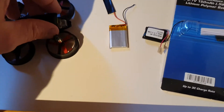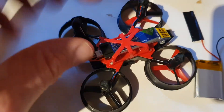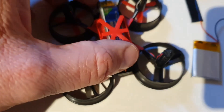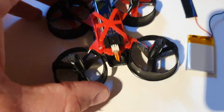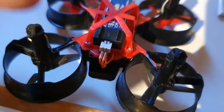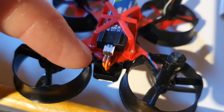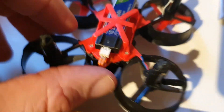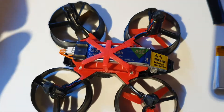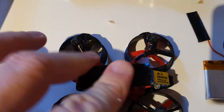It's the same weight, four and a half grams, so I got lucky there. It actually fits if I slide it in, and it has a tiny connector. I happened to have the female side of it, which I soldered directly onto the motherboard, so the battery connects right in.